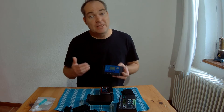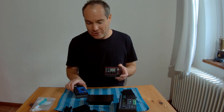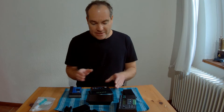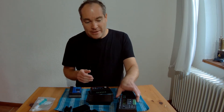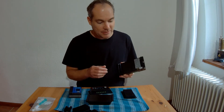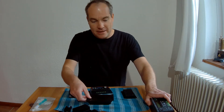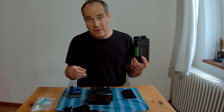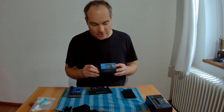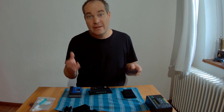The good news is it's very easy to fix. These very cheap charge controllers sometimes look a bit different, but inside they are nearly always the same. This older, maybe 15 or 20 year old PWM charge controller has a small heat sink and a massive metal case, and it's certified for only 10 amps. These cheap controllers are sometimes sold as 30 amps or even 50 amps, and without any heat sink — and this is exactly the issue.